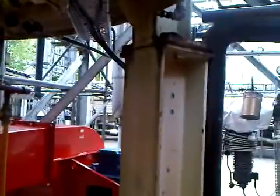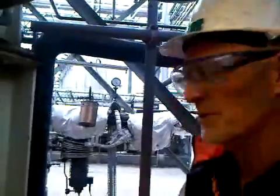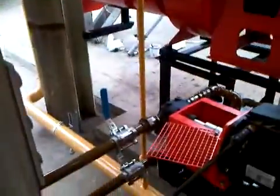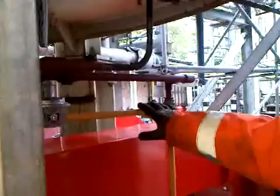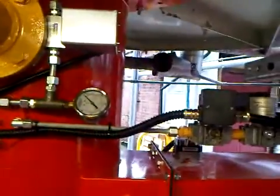Previously the pilot was from an unboosted supply, which was unreliable for the customer. So we've rerouted it to a boosted supply, which comes up and connects onto a standby LPG connection, which is here, and through our gas train, so we've got a single pilot train.